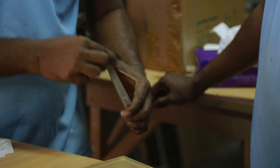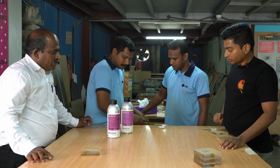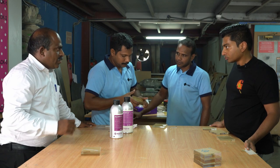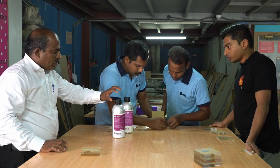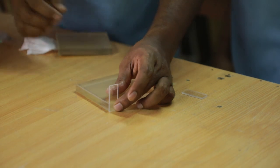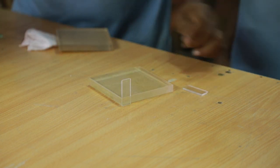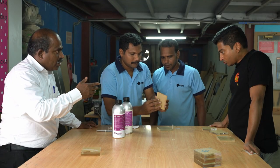With Acryfix 192, you can use it for acrylic thicknesses from 10 mm up to 30 mm. We use this 192 wherever we need high strength or long-term purposes. The specialty of this 192 is that the hardener is already included — it comes with the hardener, it is not separate. The hardener helps the Acryfix to dry faster. And the method of applying the Acryfix is different from the 127.